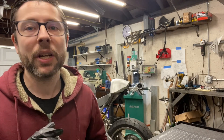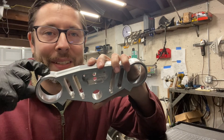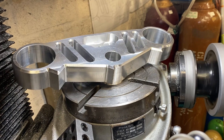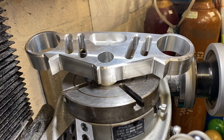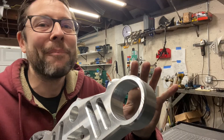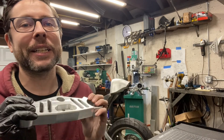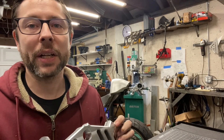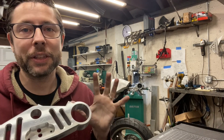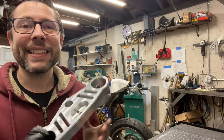Definitely all the aesthetics were really hard to get right on a manual mill. Things like where this radius meets this straight edge — very hard to get right, especially with these chamfers. I'm not going to say I'm super happy with it; I am mildly happy. After I get everything machined, I can clean it up with a Scotch-Brite wheel on the die grinder and get it good enough aesthetically that I'm happier with it. So that's the end of part three.